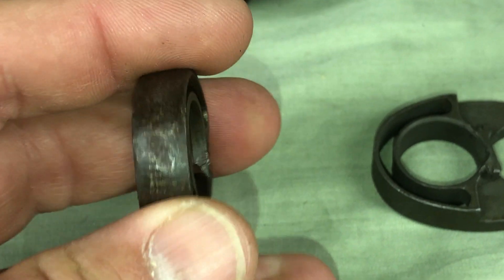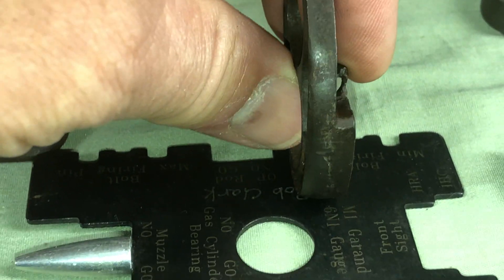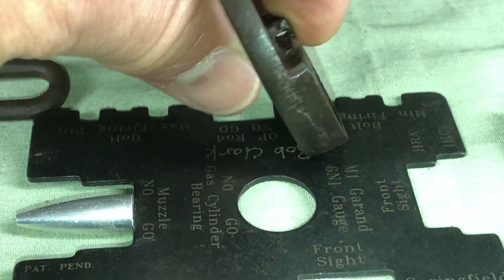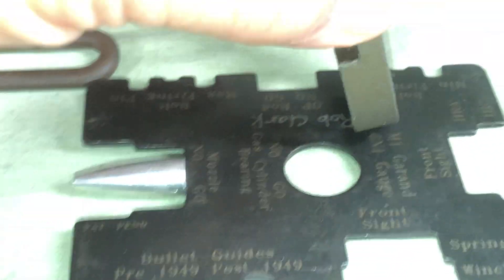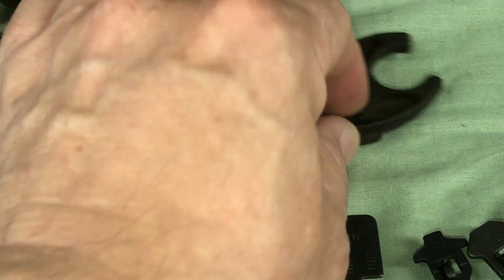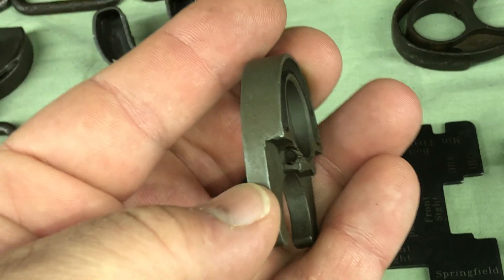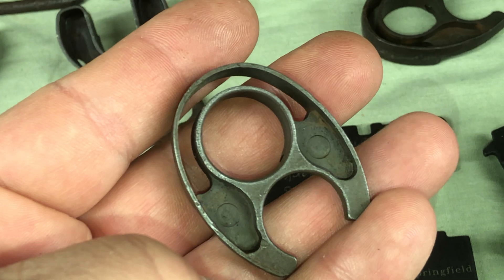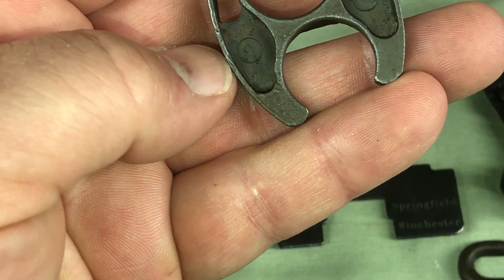I don't have the earliest one where there's a groove cut in here. This is a Winchester - this is arched, and you can see the chatter marks going across the top. The best way to tell if things are arched or not is put it on a piece of straight metal and rock it - it'll roll across nicely with no noise. But if I grab a flat profile one and put it down - can you hear that? That's how you tell the difference. This is a brazed one; this is a single milled one. The brazed ones you can sometimes tell by a little line - that's the outer edge being brazed on.